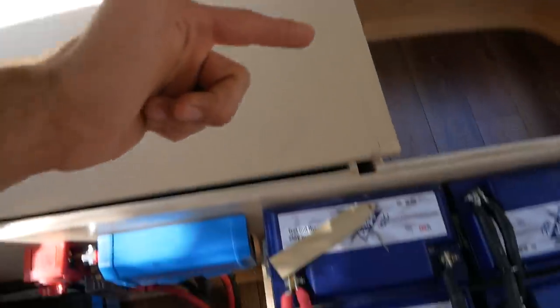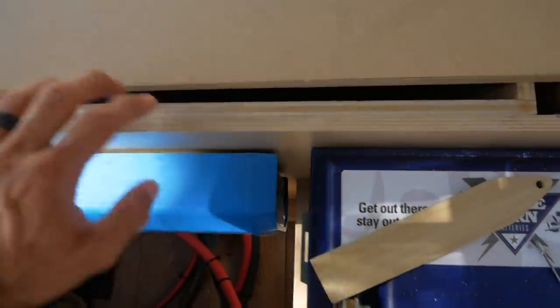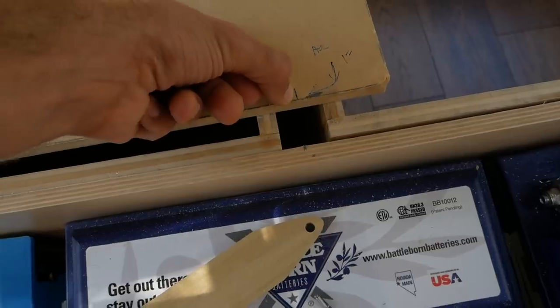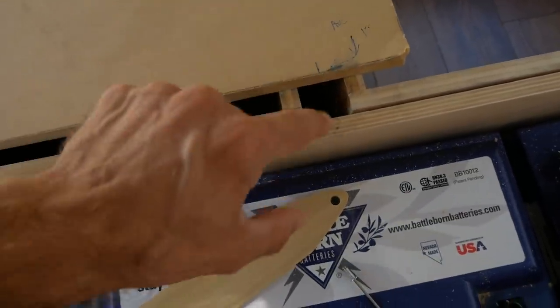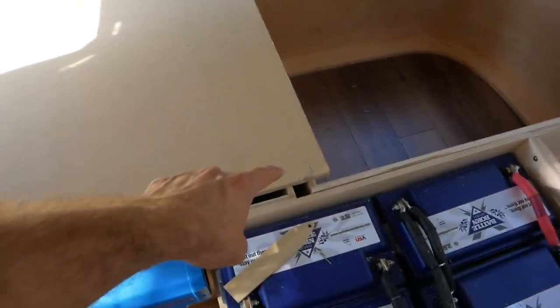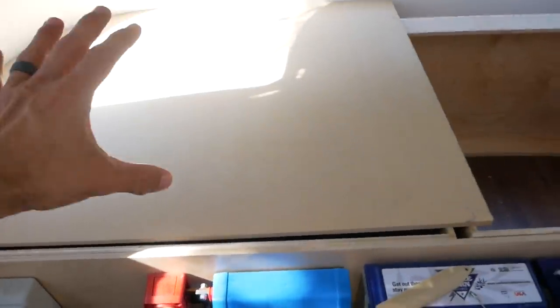What I have to do now is make the whole piece — the plywood needs to extend from the back wall all the way to the middle of these two boxes, right where they meet. As I was shaping this jig, I worked out material and it got too small, so I've measured the midpoint. I need to add an inch here and an inch and a sixteenth at this other point. When I trace this pattern onto my actual plywood I'll make sure to add those measurements on there, and then the next step is to take this into the shop and make the actual piece.